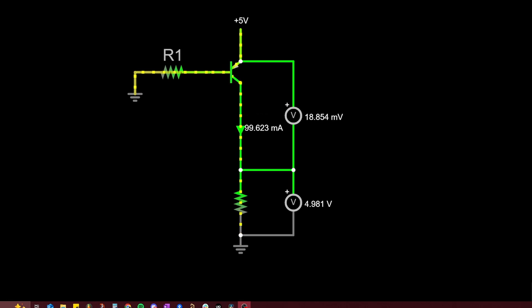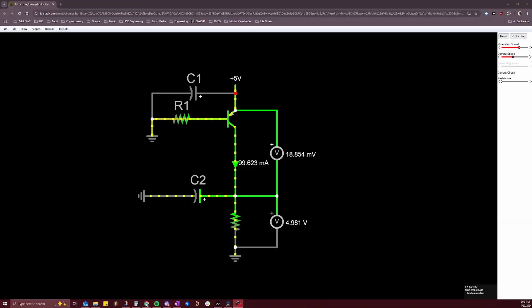This dropout requirement is primarily due to the voltage drop that occurs when the transistor is operating in saturation mode — that is, when it is all the way completely turned on. For an LDO, there really isn't a traditional power stage like you might see with other switch mode topologies such as a buck converter or a flyback converter. The primary component doing all the work is just one single transistor. It is common to see both input and output capacitors on linear regulators to prevent signal noise from disrupting operation and to improve transient response. Besides that, there are no other key components in the circuit.